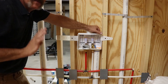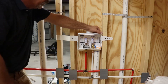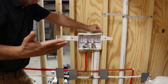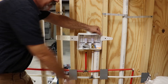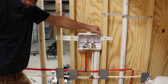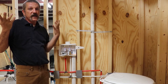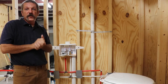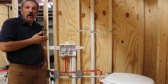This is only in some counties — you've got to check with your field manager, the inspector, or your builder to see which method of testing applies. Filling the stack up from the vent is pretty much everywhere, but in a few counties you can fill your washing machine box up to that knockout if it's upstairs; if it's downstairs, you'll have to do that 18-inch riser thing. You're going to fill that drain waste and vent system up with water and spend some time walking around looking for drips and leaks. Not a whole lot of pressure on DWV, but it has to be sealed to pass inspection.